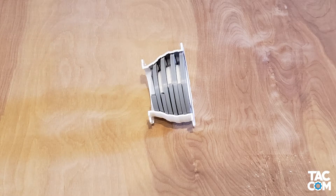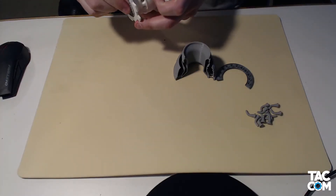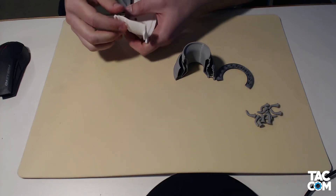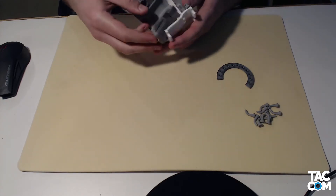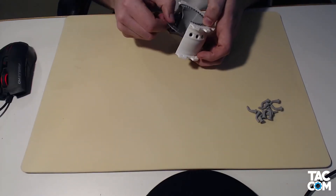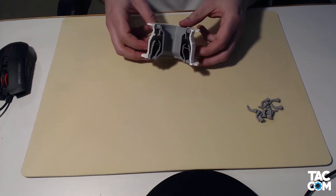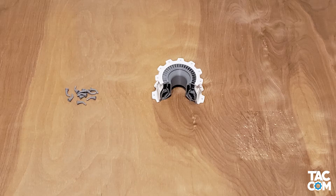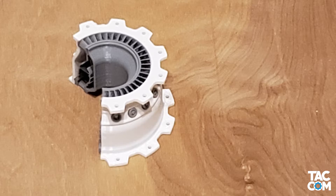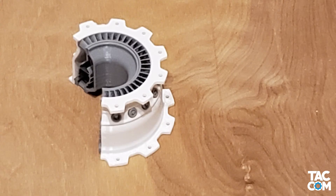It's time to move to the combustor. We'll start by taking the 5th stage HPC rotor that we put aside earlier and sliding that one into place. Now bring in the combustion liner and slide it in from the other direction. The combustor dome plate goes in next — just put it in the general right position and rotate it around to work its way into place. We're now going to take all 11 fuel nozzles and push them into their slots. I found it best to start with the two outside ones, then a couple in the middle, and fill in the rest. The combustor is now complete, and we've finished the module dry fitting.